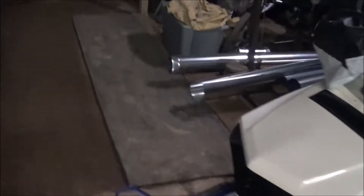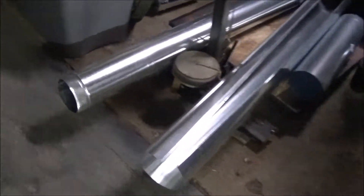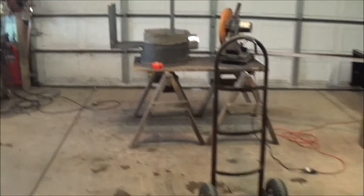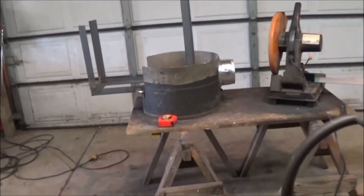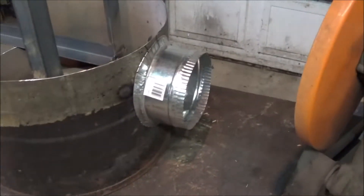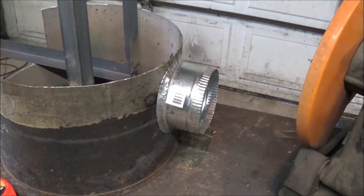I could not find anything reasonable, and it's galvanized, so it will have to be all burnt off. I'm going to use this as stove pipe — I don't know what it'll do, but I will definitely burn it outside for a while. This piece here will not get hot enough to burn the galvanized off. Theoretically neither should this, and even the outside exhaust — from what I've seen on YouTube, they just don't get that hot.